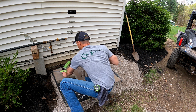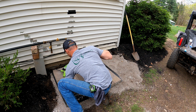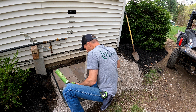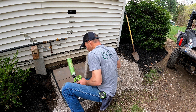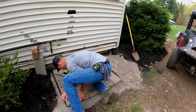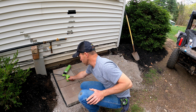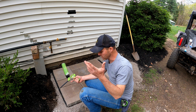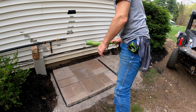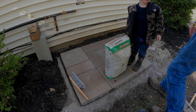Generally there's a plastic edging you put in with a special screw that binds into this material, but that's not an option right now so I'm going with adhesive. The great thing about this adhesive — as opposed to standard construction adhesives like Liquid Nails — is that it doesn't artificially raise the paver surface. You put a standard construction adhesive in there and it'll raise it an eighth of an inch or so. Structure Bond is actually one of our first sponsors of the Kid Contractor Podcast, so thank you to Techniseal for that.